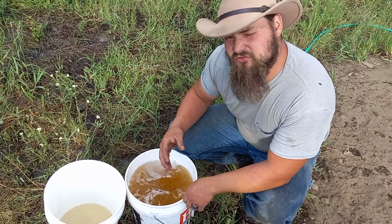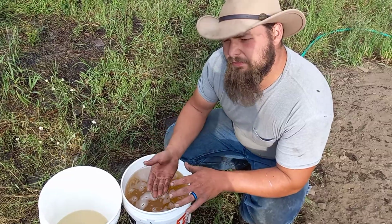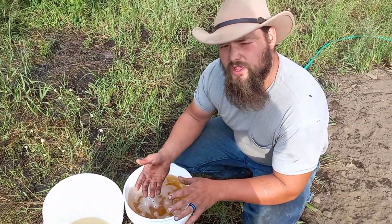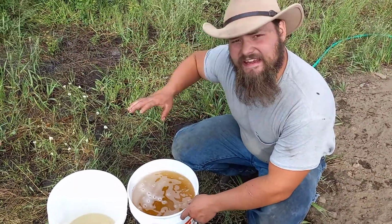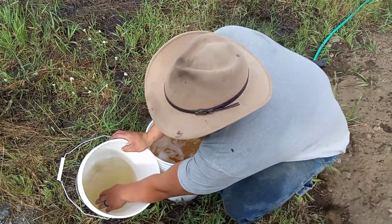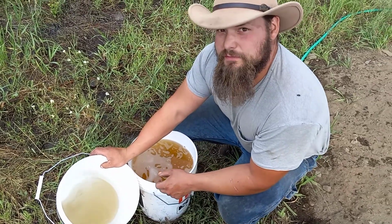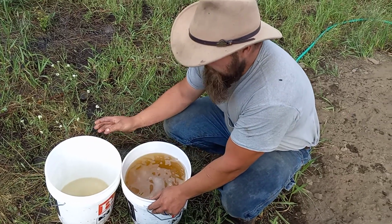And it smelled quite strongly of bleach. With the depth of our well and where I've set the pump, we have almost 300 gallons of available water at any time. So we have just pumped it again until we lost water pressure. This is what we started with, and this is what it looked like just before we lost water pressure. You can see it's more like pear juice or peach juice from the carrot juice. And so it's getting progressively better.